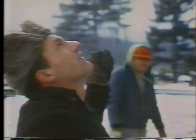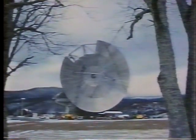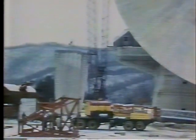The truss-stiffened legs will prevent its deflecting more than 3/8 of an inch from wind or gravity under normal observing conditions. The vertical axis of this support, in line with an instrument support stand above the apex of the paraboloid, determines the focal axis of the antenna. All components are adjustable to assure the correct location of this axis with respect to the surface. After the feed support and instrument stand are in place, the last panels are installed.